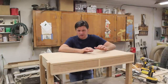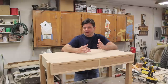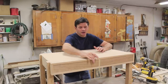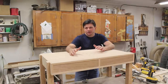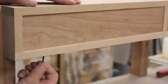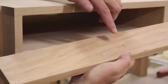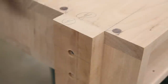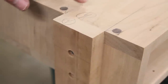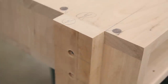Now I'm ready to finish sanding this piece of furniture. The first step is to remove any parts that will make the sanding job easier. In this case, I'm going to remove the legs, remove the backs of the cabinet, and of course remove the drawers and sand them separately. I attach the backs with three screws from the bottom, so I'll mark the inside of the back and the space where the back is going to go — that will make reassembling easier. The top of the cabinet will be sanded after the legs are reattached, so I've marked the top of the cabinet and the top of each leg, and these marks will be sanded off during the final sanding.